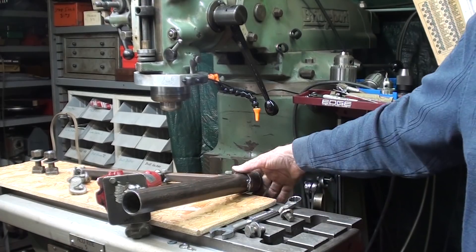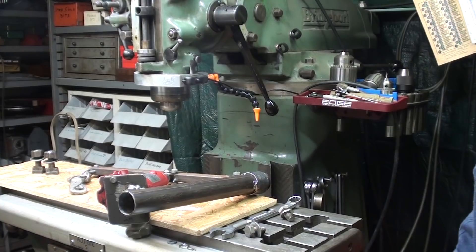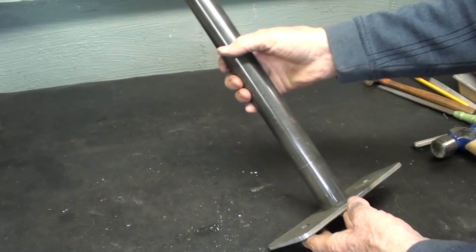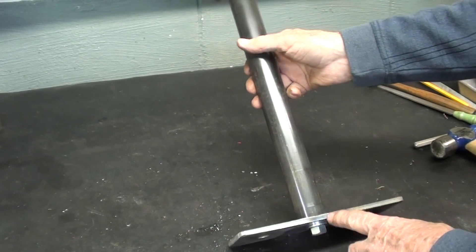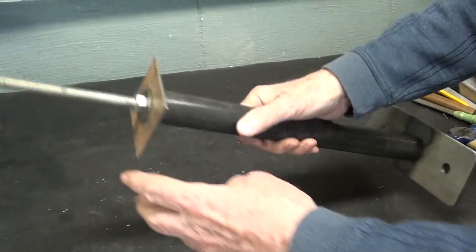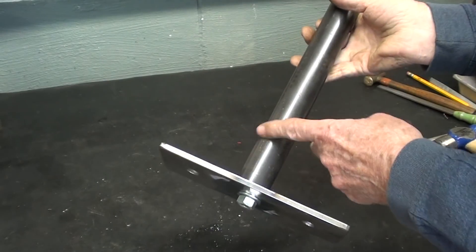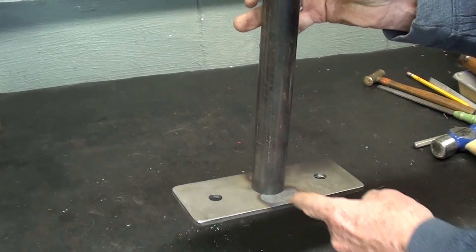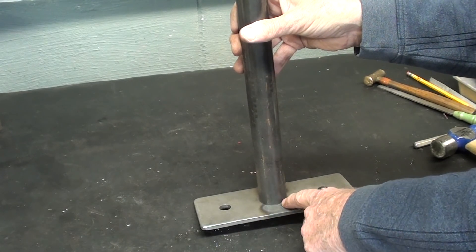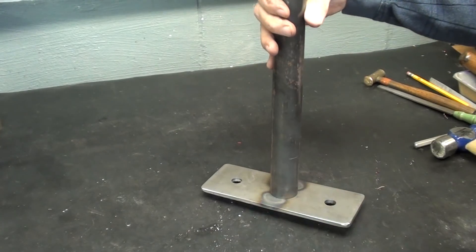The other part I'll take apart and I have a little de-rusting to do on the boom. This clip should have been in part one, but whenever I weld something and I want it to be perpendicular, I've always — for 45 years — tended to use a piece of threaded rod like this, with nuts. I faced the ends so they are perfectly square, draw down tight, and it usually will hold, although if you weld too much on one side she could still warp on you, so you've got to keep those welds even.